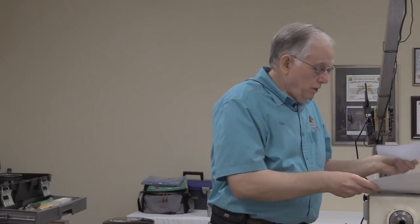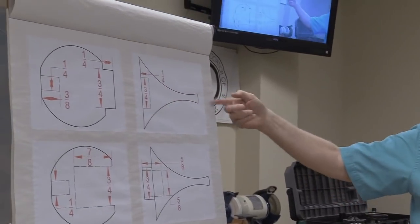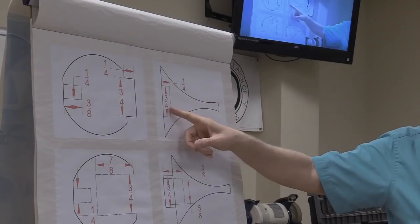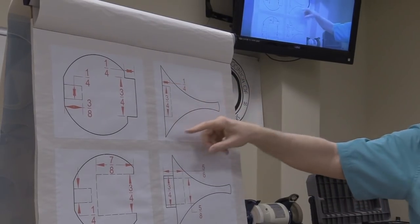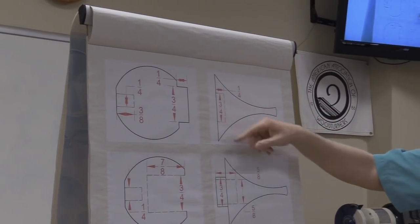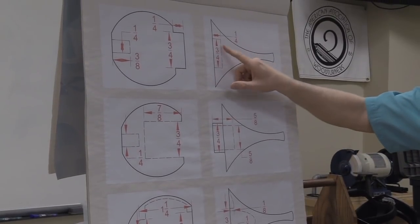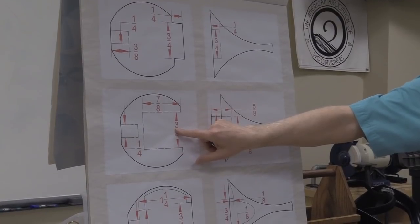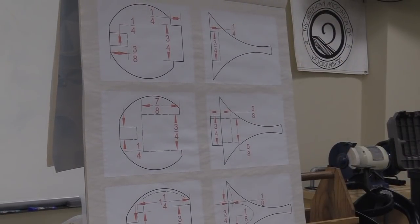Body. Now, when I turned this, it was in that orientation on the lathe. The chuck was up here, and I bored a 3/4 inch hole in there, and then brought the live center up to support it and formed this all without reversing it. You could reverse it on the same fitting I want to make for this chuck down here. I could have used the top and reversed it onto the fitting that I'm going to make for this one. It's only 1/4 inch deep, though. It's not going to give you that much support.